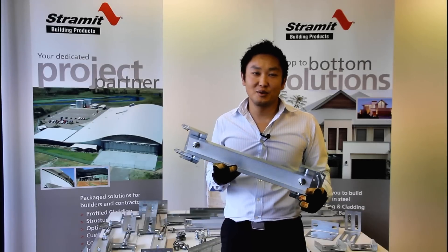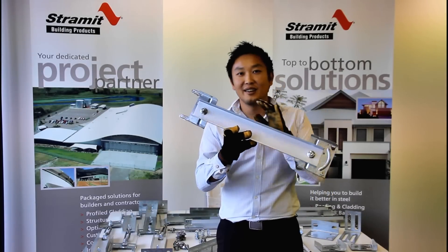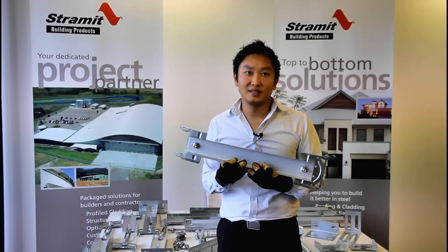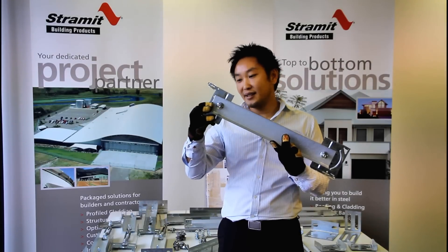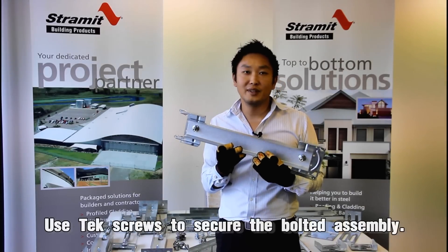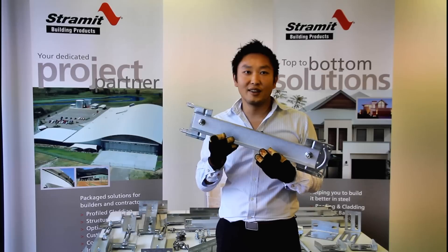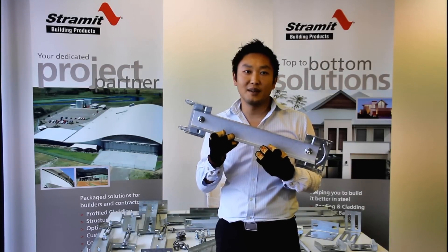Finally, we have a piece called swivel bridging. This looks like a standard ordinary piece of bridging — it has a lock and a locator at each end and a channel in the middle. But you'll notice that it uses a single bolt at each end of the channel instead of a TOX connection. This allows the bridging to swivel and you can use it as an expansion joint. Alternatively, swivel bridging can be used on a curved roof and you can vary the angle of the end plates to suit the roof curvature. When you use it this way, each lock and locator must be secured with a TEK screw after placement to ensure it doesn't slip after you've tightened the bolt.